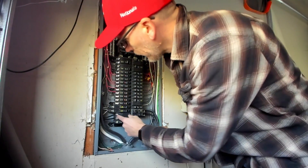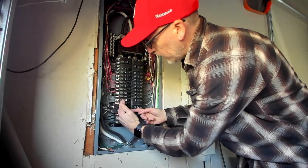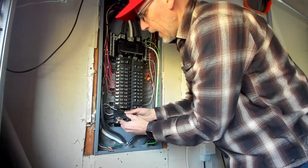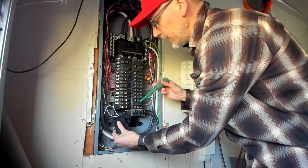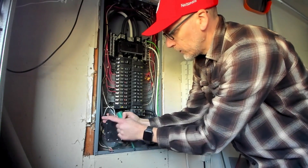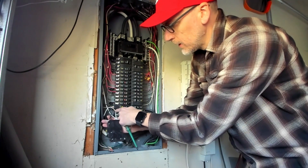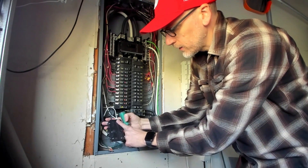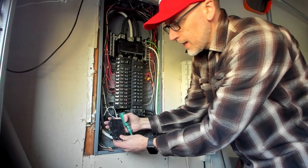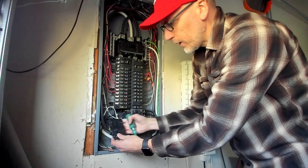Looking here at number 31, which is right here. To get these to pop out, they're swiveling on - there's a junction point where they connect and sit on there, you can just pull it out and see if it pops out. This one's running 10-gauge wire. What you'll notice differently if you've changed other outlets before is that this is a GFCI, so the neutral comes in. The neutral that goes to the outlet comes into the breaker and then goes up to the neutral bar. That's where it can sense any leaked voltage - it knows what's going out and coming in and can determine the difference.